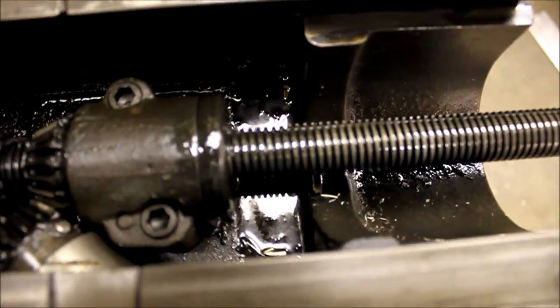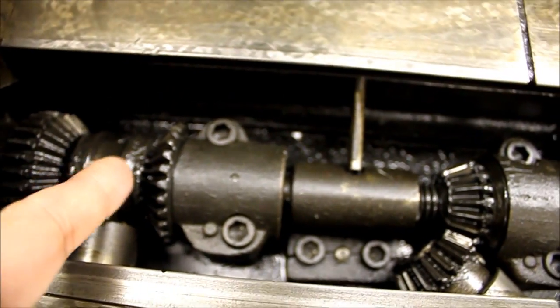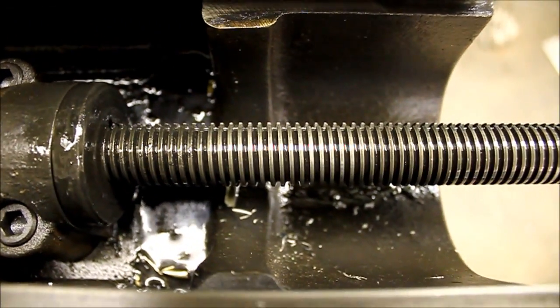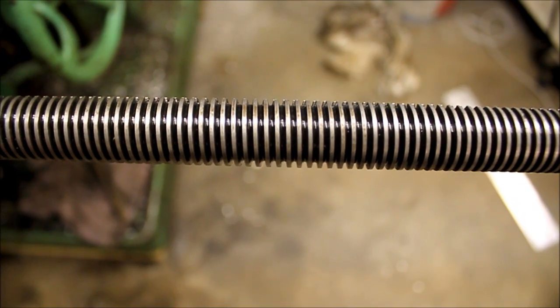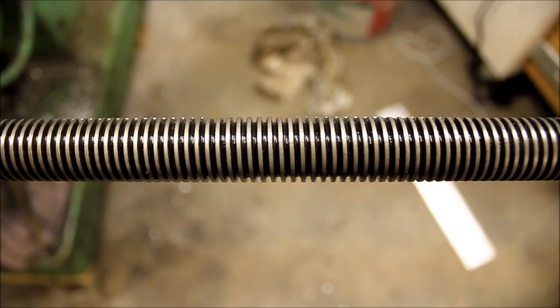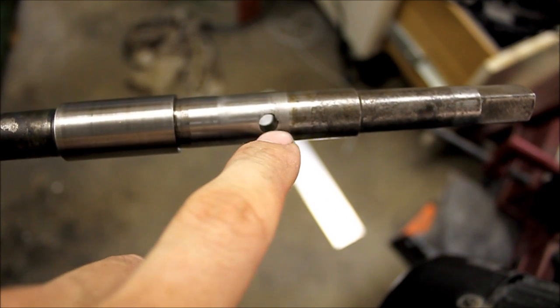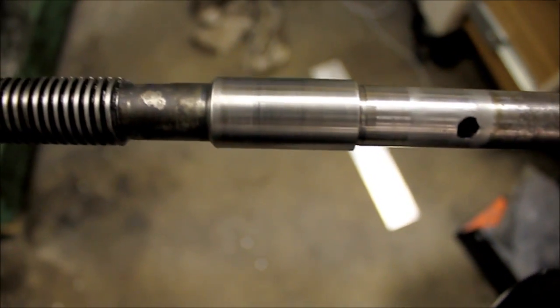I wanted to show you the condition of my X screw and brag a little bit. This is pretty much the end — I think the screw ends right about here — and it's in pretty good shape. Taking you down the screw, there is a bit of wear, but almost no wear on the X screw. Somebody also drilled out and put a pin through this collar — usually those collars are mounted with a set screw. Just some more evidence of repairs. I'm guessing this is the original lead screw.